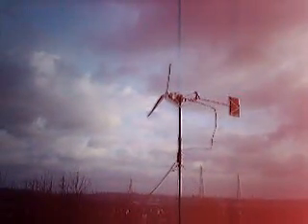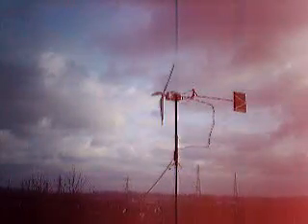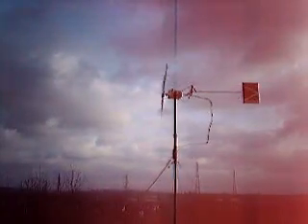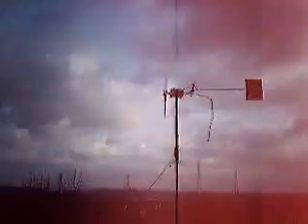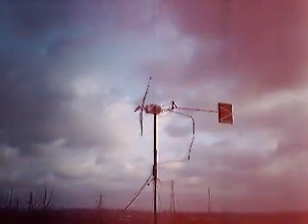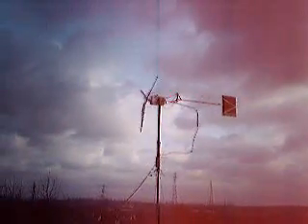On the leading edge of the blade, I've made the blades the exact same profile as an aeroplane wing. It's kind of thick at the leading edge and on the back of the blade it's filed into a knife edge. So the blades are very quiet and they go very, very fast in the slightest of wind. If you look at the trees just now, the leaves are just flickering and no more, and they're still managing to get 120 revs out of the blades — very, very fast.